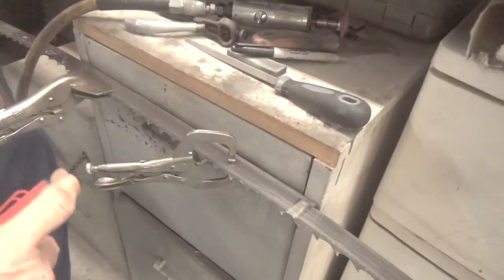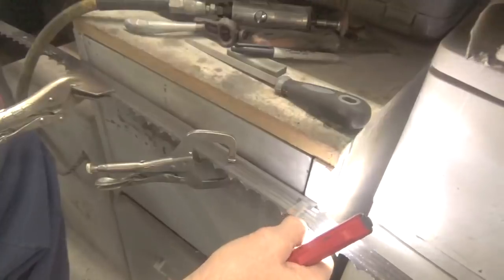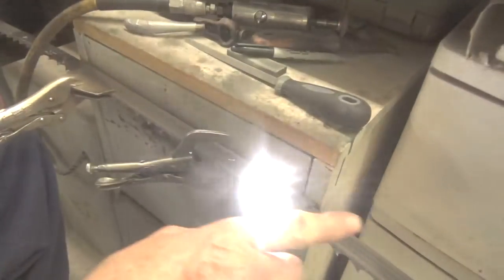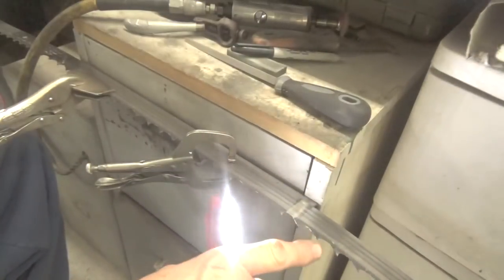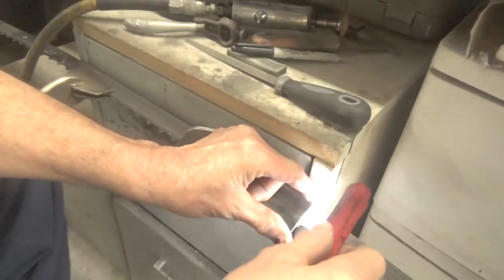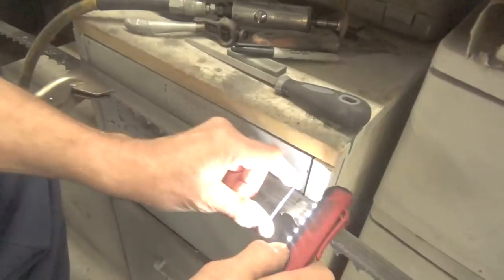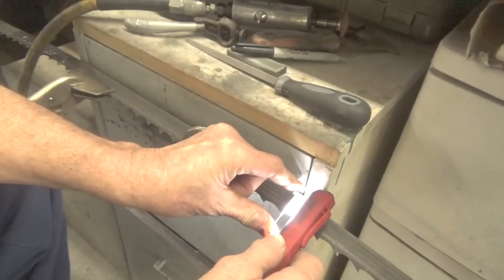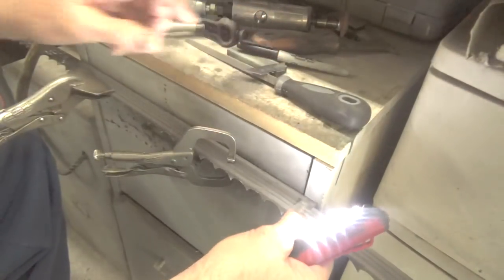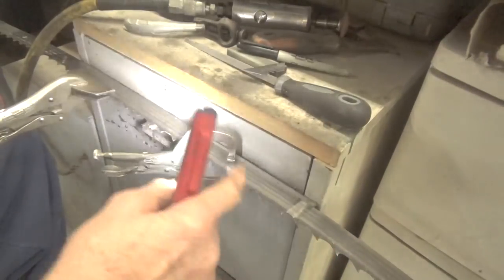So then what you do to find the saw set, normally what I found out with the weld is usually the one right in front of the weld, in other words the blades are going that direction when it's running in the saw, usually this one is a straight one. So what I do is I lay the blade down and I look across it, and you can tell by looking at them which one goes which way. Now this one is a straight set, in other words there's no set to it. This one sets down, this goes down, and this one comes up.